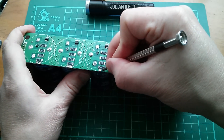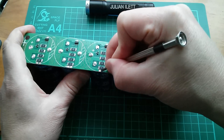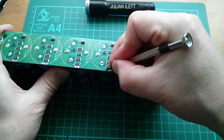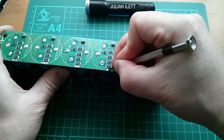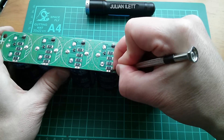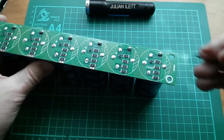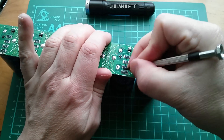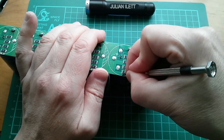It's easier to do it this way around. I just want to expose a little copper square on each of these six protection circuits so that I can put my little blue LED on there, because I like to see when these protection circuits switch on. There's no indication without these LEDs, and that's something I think is important to see.